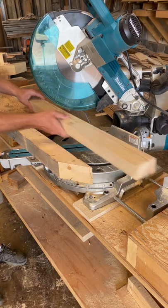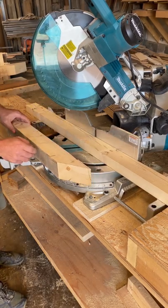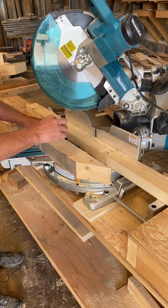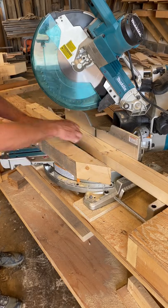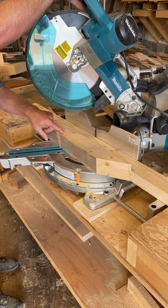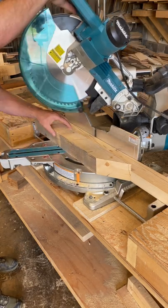When you go to cut, you're going to want to put another board in behind, or else you won't cut all the way through before the radius of the saw comes up at the back side. Setting something in the back both protects against blowout on the back but also gives you a nice clean line all the way through. So I'll cut the front side and the back side and then carve out the middle.